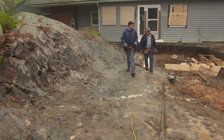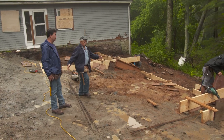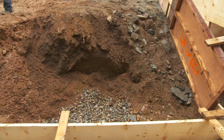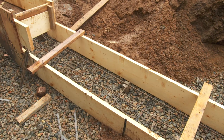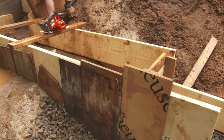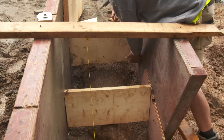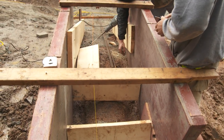We hammered the ledge down to where we need to be. As you can see, the outline of our garage is starting to be formed. The garage is going to be 24 by 24. This side of the foundation is going to sit on the ledge. Over here, we had to come down and follow the slope of the ledge, and we're at the low point down there to be below our frost line. You dig down, put stone in there, level the base, put your forms in place, then pour your concrete. Because of the slope of the land, we have to put a series of dams in — one dam there, and as we turn around the corner, there's another dam — so that the foundation will sit on a stepped footing but the top of the wall will be level.